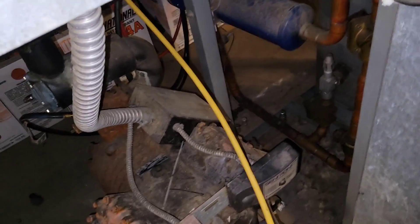While that oil is pumping out, we're going to take off the head of the compressor and look in there and ohm it out. I'll teach you how to do that — it's not rocket science, it's not too hard.